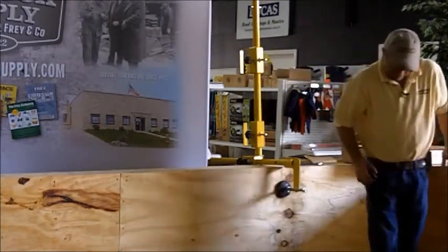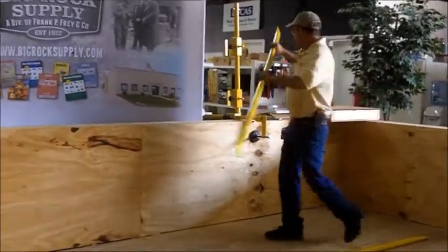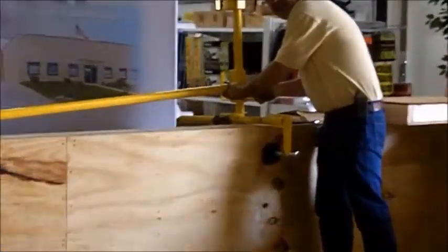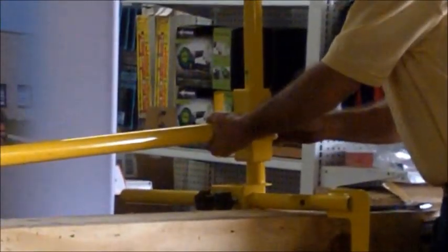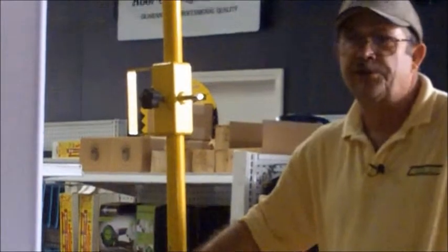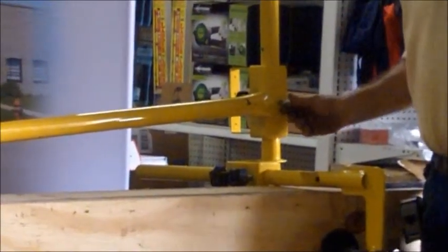As you're moving on, take your rails — they just snap right on with a simple scaffold drop lock pin. They are secure and will not fall out. Make sure that your pins are always facing your work surface, so that as you apply pressure to the rail it is pushing against the post and not onto your drop lock.